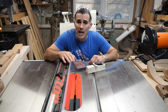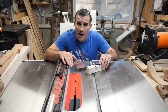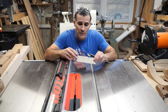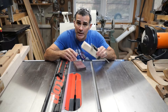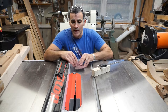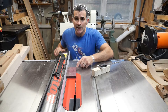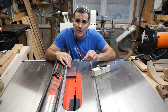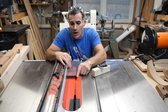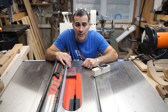While the glue is drying on the jig, I'm going to cut the splines we're going to use for these joints. For this demonstration, I'm just going to use joints that are single passes on this saw. What we need to do is identify the kerf, or the width, of the saw blade. I've gone ahead and taken a pass on this piece of wood and measured it — it's an eighth of an inch. I knew these blades were an eighth of an inch, but I'd rather measure twice and cut once. So the next step is to align the fence on this table saw for a clean cut. Then we're going to double the kerf of the blade — take an eighth inch, double it to a quarter inch. That will allow us to get a cut that leaves us with an eighth-inch spline, because an eighth of an inch of material will be taken away by the saw blade as we make the cut.